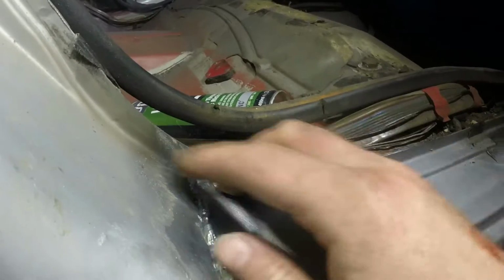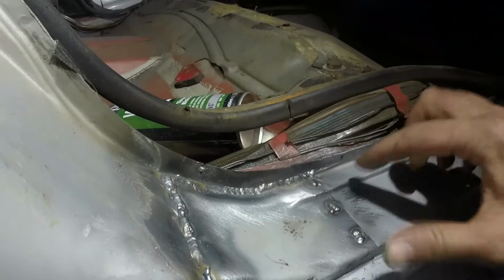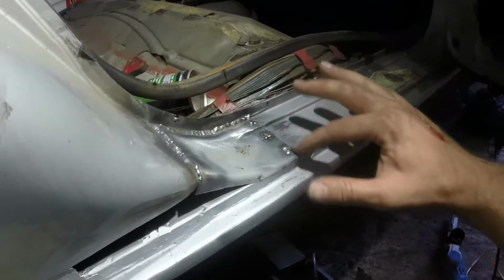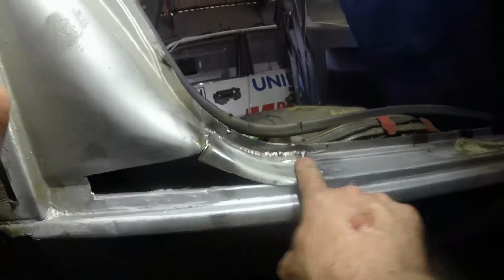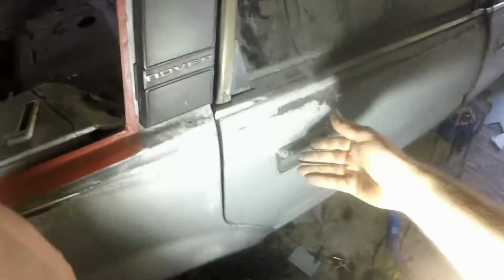I've done a really nice little fillet weld in there, so that should grind back and be quite smooth. It all gets hidden by the door seal anyway, but that's good. That step looks nice. This will all be linished smooth, as will those. Then I've tapped this round and I've still got that nice curve there. The door, which is also important, opens and closes without hitting.